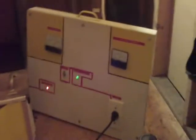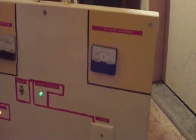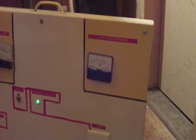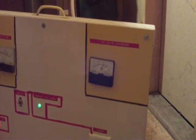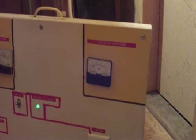And let's look at the ammeter. You'll notice that when the gap is open, it draws less current. Watch what happens when I close the gap and we short out the transformer — I'm going to do it right now. You can see the needle jumps when we draw more current. And then we open the gap and the arc breaks, and you can see the needle drops down.